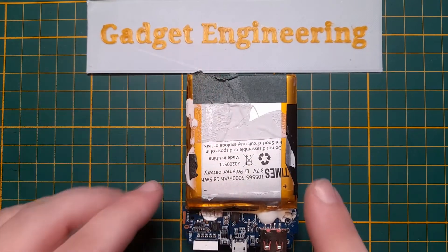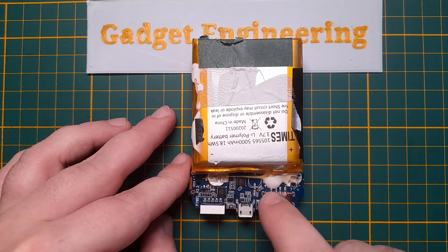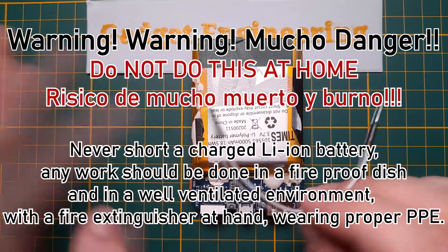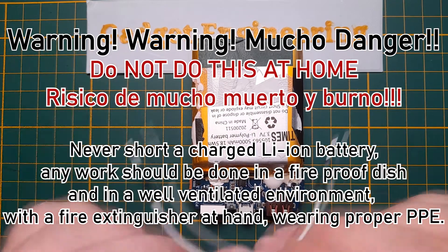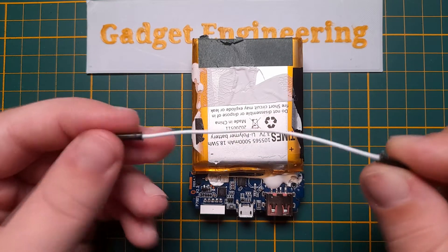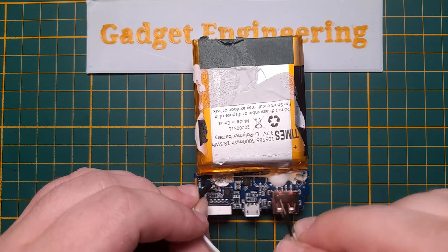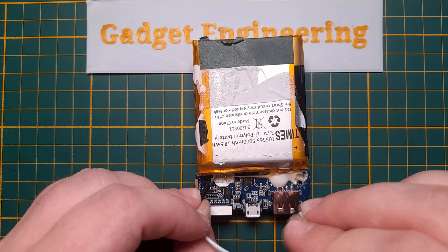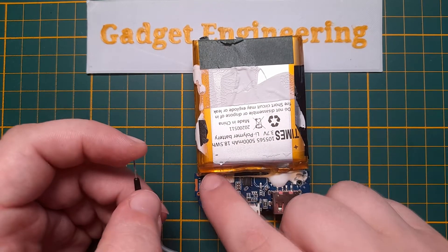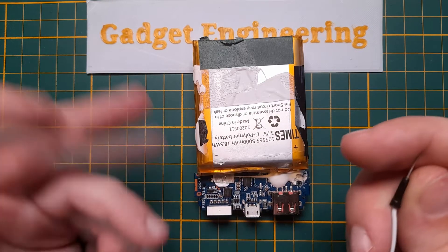My solution to resetting the microcontroller was to short the 3.7 volts going into the board with a small wire. Important warning: do not short lithium batteries — they'll go up in flames and burn down your house. Do not try this at home. In this case, I used a very thin gauge wire, maybe 22 to 24 gauge. I shorted it super quickly — maybe half a second — just touching the connector on the negative pad and the positive ribbon. The short length of thin wire acts as a very low value resistor, pulling down the voltage to the control board just long enough for the CPU and MCU to reset itself.